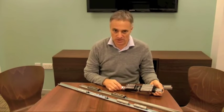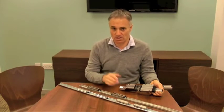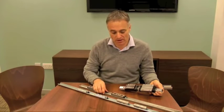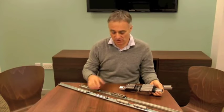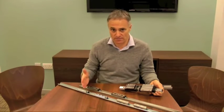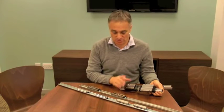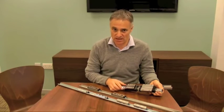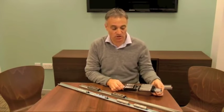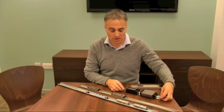If you don't install the standard linear guideway correctly, you risk stiction as the system travels down the track. Whereas with the Compact Rail system, because it operates on a master rail and slave rail, it takes its accuracy from the master rail and the other rail is floating. For very heavy duty loads and heavy moment loads, the standard linear guideway is a good system, but it's quite expensive to install when you have to machine the parts.